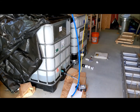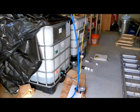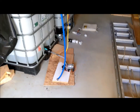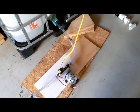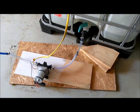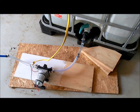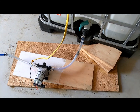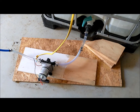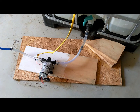The job for today is to get these two 300-gallon water tanks — IBC totes — plumbed up in a more permanent fashion. Right now you can see my water pump, and I've got a hose kind of jerry-rigged over to the outlet of the tank. What I'm going to do instead is replace that with solid pipe and connect the other tank up at the same time. I'm also going to make a more suitable base for this water pump, as well as installing a strainer and accumulator for this pump.